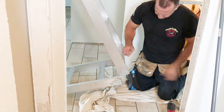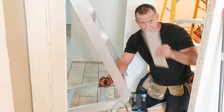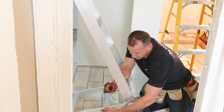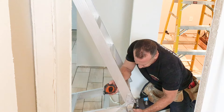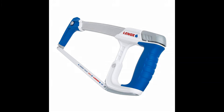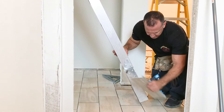Get the measurement from here to here — we have 16 and a half inches. So we're going to take 16 and a half inches and knock 3 inches off of it, bringing it to 13 and a half inches, and cut it there. If you don't have a reciprocating saw you can easily cut this with a hacksaw. From the joint to the floor was 16 and a half inches, so I measured from the joint down 13 and a half inches and cut it. That leaves a 3 inch gap. You can leave as much as a 6 inch gap because the filler plate that covers it is 12 inches long, giving you a couple of inches to spare to slide up and down.